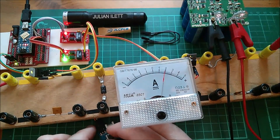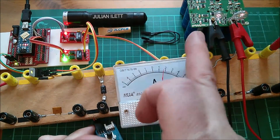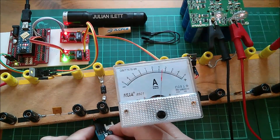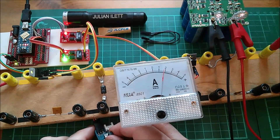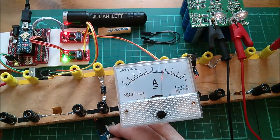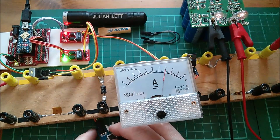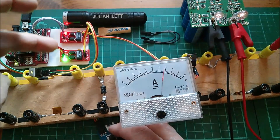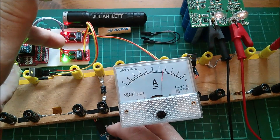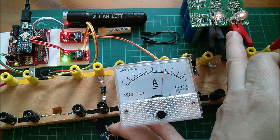That's dropped way back so let's get that back up to two amps. It just keeps falling back because the voltage on the supercap keeps coming up, so I've got to keep nudging this pot up - what I'm really watching here is the current, that's all I'm watching. I'll know when I'm at 12 volts because the second driver module will start to come on at 12 volts. Oops, that's three amps. The red LED is getting quite dim on the buck module so that must mean we're approaching 12 volts. That got up to 12 volts very quickly.